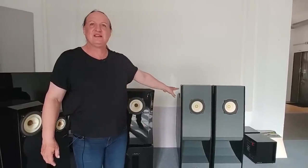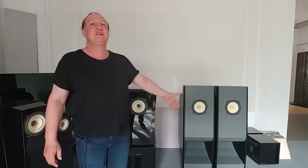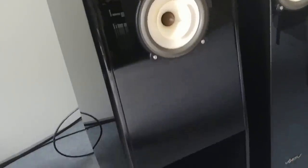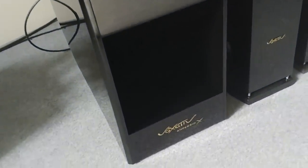After nearly 10 years, there is a new speaker called Ampeggio X, and this has a field coil driver — meaning the depth is increased. A normal driver has a permanent magnet system: you have a magnet ring — neodymium, ferrite, or Alnico — and you glue it together with two steel plates and you have a magnet. Very simple.